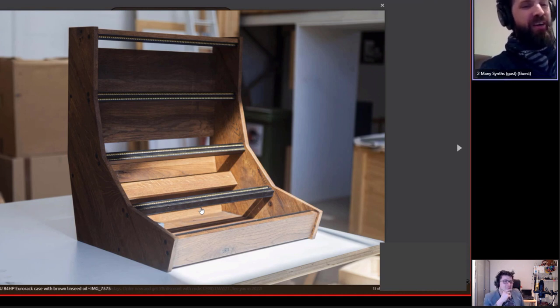Yeah, but I buy the rails in bulk, 2 meter pieces, 40, 60, 80 pieces per color, and some restock, and then I cut it to size. I rarely cut it to size in advance, so I don't have cut-to-size rails in stock, but I have the 2 meter rails in stock because I tend to cut them to size when I cut the horizontal panels, so they are on exactly the same width. So you have a super flush fit. That works best. Especially because there are people who say, I have 84 HP, but can you make it 88? If you cut it to size in advance, you have to sacrifice 104 rails to cut it to 88. And then I have loads of leftover pieces.